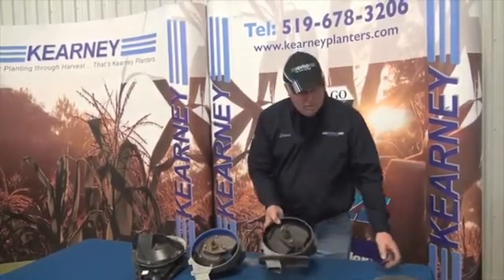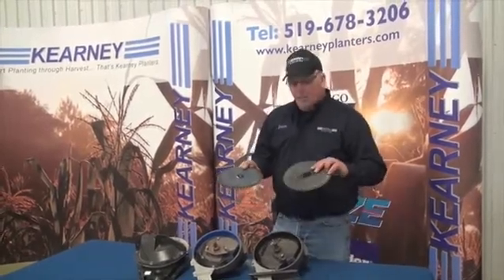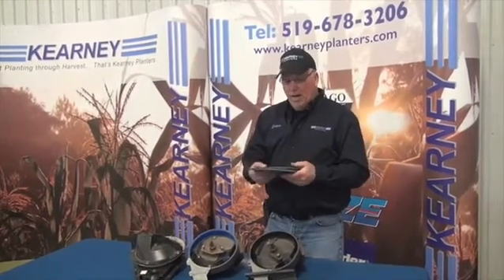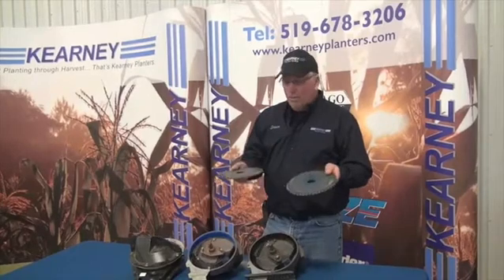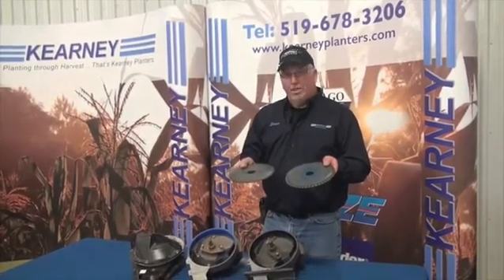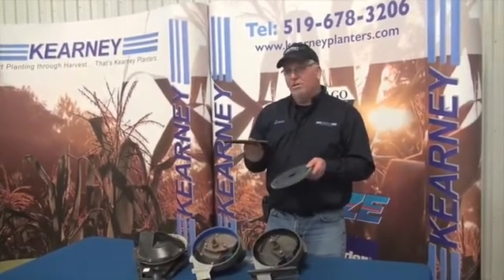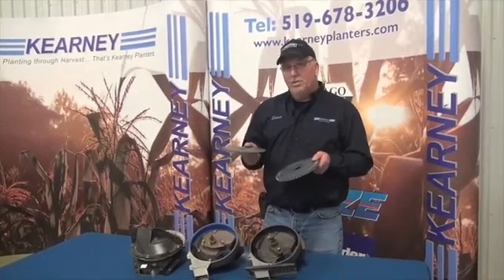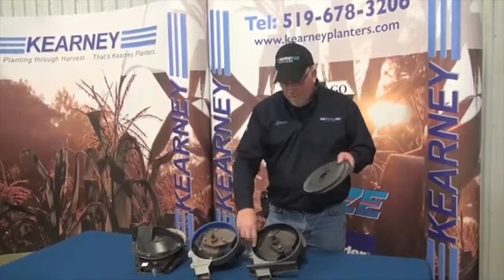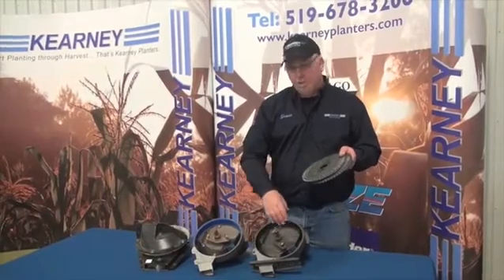If you're not sure how to set up the brushes or check that they're in good shape, take it to your dealer and have them check it over. Also with a brush meter, being a mechanical meter, we have two different plates to offer. Make sure you check it in the wintertime according to your seed sizes. The best way is to take the largest seed out of your sample and try it with your plates — that way you have an idea of what plate you're going to use come spring. Always remember: do not put your plates in until just before planting, and take them out as soon as planting is done. If you don't do that, you will ruin your brushes on the brush meter because they will stay pushed down all the time.